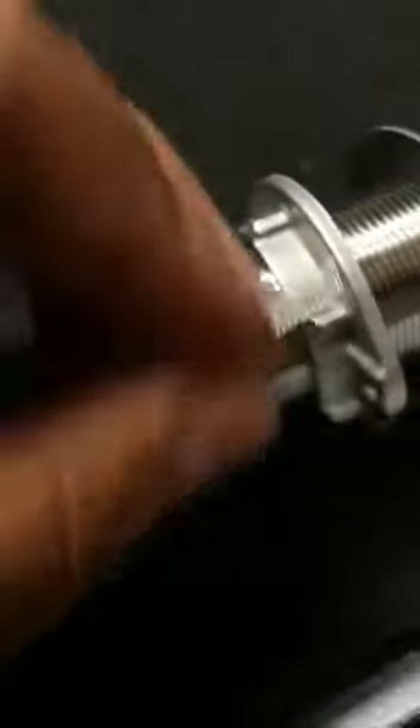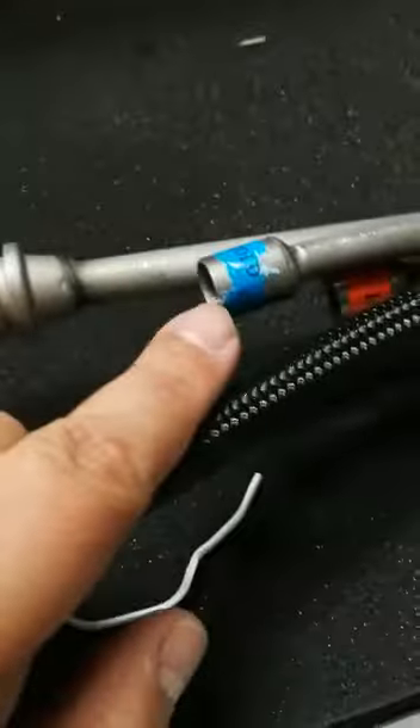When you're done installing, to hold it in place you'll need to install the screw that comes with the faucet into this hole. Then once you've got this installed, attach your cold line here and your hot line here.